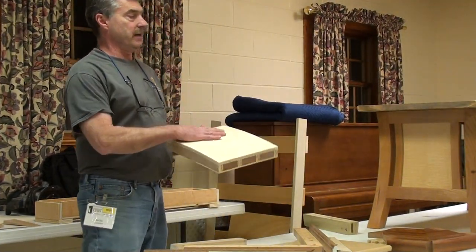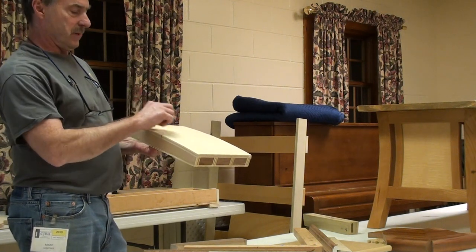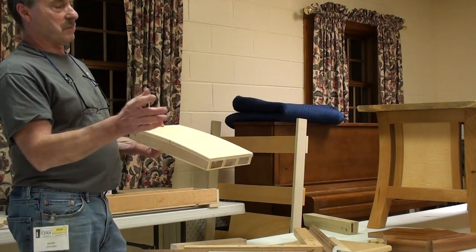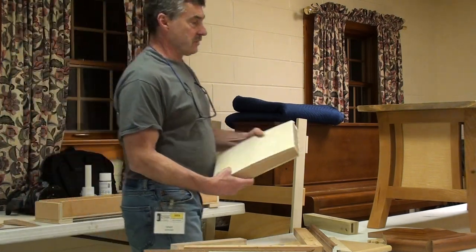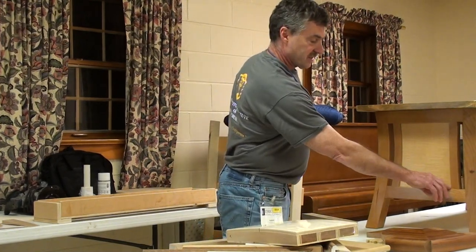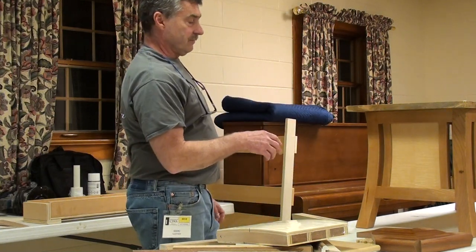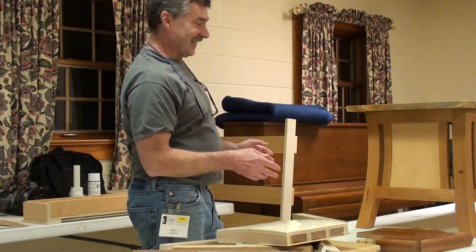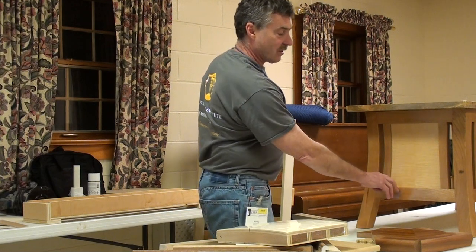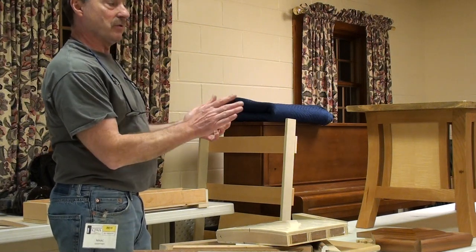I built this form, and it worked great. I put it in there, pressed it all at once — maybe I did just the two pieces and then did the veneer after. It came out of the form and there was no springback; it was really good. It really mimicked my shape. But then I had to cut a rabbet for this thing to sit in, because it's essentially a raised panel, even though it's a plywood panel. The bottom of this is on an angle and it's got to all register, so I actually used a trim router for that, but every fence had to have its own characteristic.